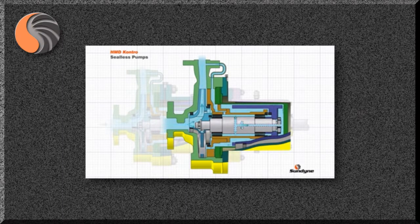If a magnetic drive pump is properly applied and operated, it will provide many years of problem-free operation. However, failures occasionally occur, usually as a result of process system upset or operational error. Many of the mechanisms that cause a seal-less pump to fail prematurely result in the breakdown of the internal flow system and the subsequent presence of vapour. This is problematic, as vapour will not provide adequate cooling for the containment shell and lubrication for the internal bearings. Some such conditions can be detected by traditional instrumentation; however, these instruments tend to detect secondary effects and not the primary cause.